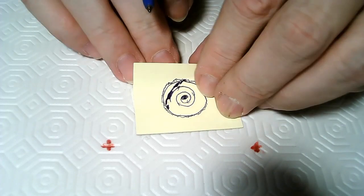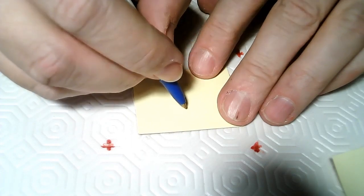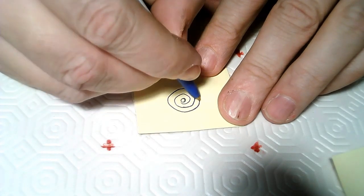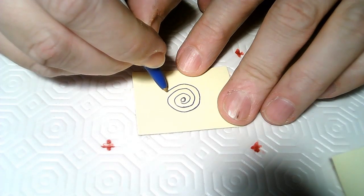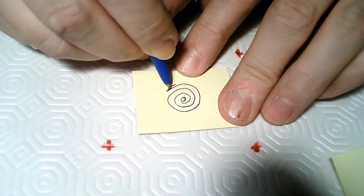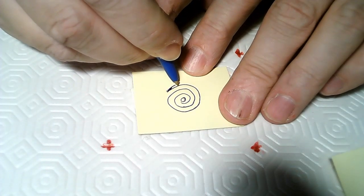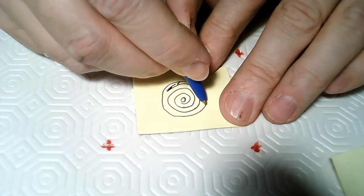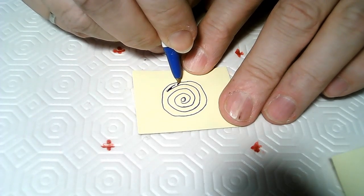So if I draw that again, which I think I will because it was a poor drawing, there's the arbor, and then the spring goes around in a circle like that, and then at some point in time it gets to the point where it needs to come back again. Sometimes you see the springs are folded over like that, and then they come back like this. I have the old Walthams and stuff, sometimes a fold over point, and then right here is a notch in the barrel that's basically punched out. The barrel goes around like that, right? And the notch is punched out, so there's a hole there, and it punches this metal back, right?